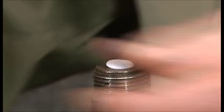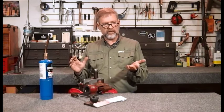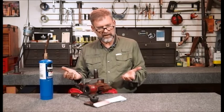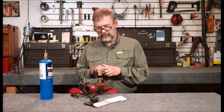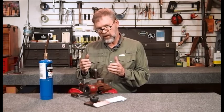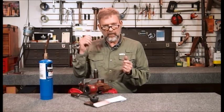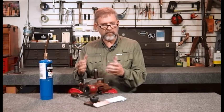The cast has already hardened — it crystallized real quick and you can tell that it's hard. It only takes about a minute; you could probably pop it out immediately, but I like to let it set for about a minute as it seems to release better from the barrel. One consideration: you might want to put a little bit of oil in the chamber and wipe it dry, which helps the Cerrosafe release without sticking at all.